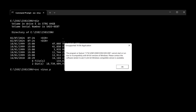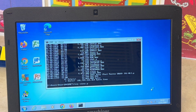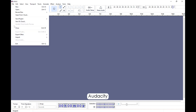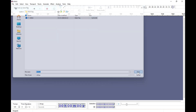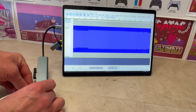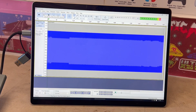It seems we need a retro backup plan. Having sourced this portable computer running Windows 7, we performed the extract again, which created a .raw sound file. Then using your audio application of choice, select import, raw data as a type, not forgetting to perform the detect function before importing. So connecting the 3.5mm sound jack, type load quote quote, press return and play. And we know it's working because it's reflecting the incoming data onto the display.